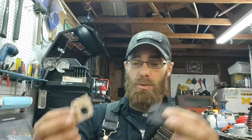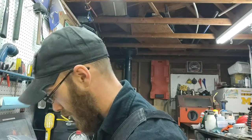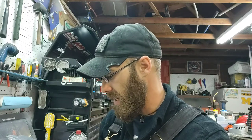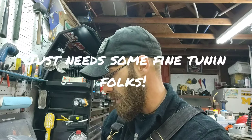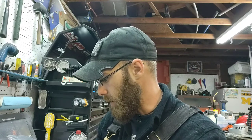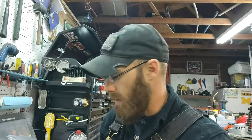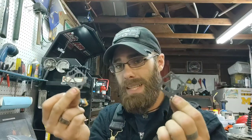Okay, so I have the two fuel pump diaphragms right here. Those do go on. There's a rubber one, and then a kind of fiber-filled gasket. I know those two go on there. But then I looked over at the old gaskets, and this is why I keep the old stuff before I throw anything away. I noticed there's a thicker gasket on here, and there are two different fuel pump gaskets.